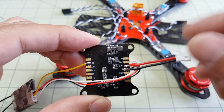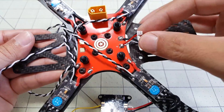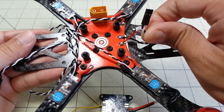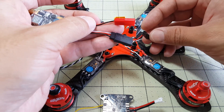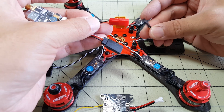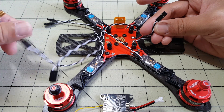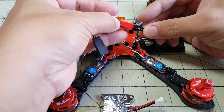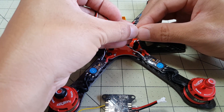I've soldered on a battery connection using a 1.25mm pitch JST connector, with the corresponding connector soldered directly onto the PDB on the quad. I also have another two-pin connector going to the video transmitter. I happened to have a hard drive LED connector from an old computer, and I took servo connectors from an old ESC to power the video transmitter — it's the same pitch and just plugs right in. Just make sure you have the polarity right because it's not keyed — you can flip it and still plug it in, which would fry your video transmitter.